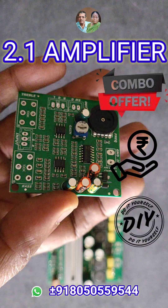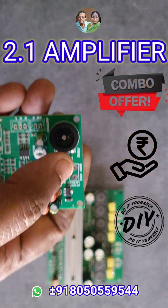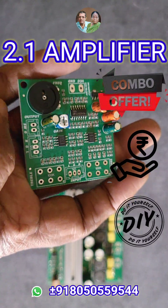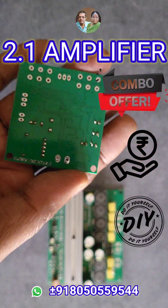The recommended voltage is 20V DC supply. The bass and treble pre-amp sub-board operates on a 12V single supply, featuring 20dB adjustment for bass and treble and a crossover adjustment from 50Hz to 160Hz.